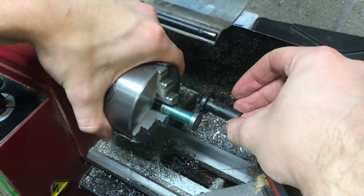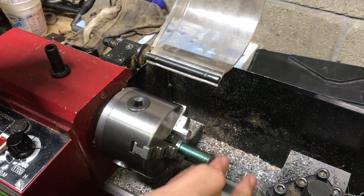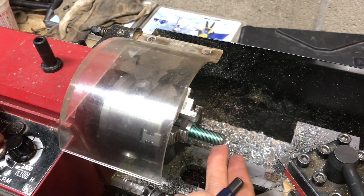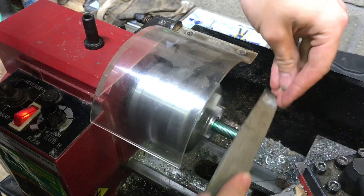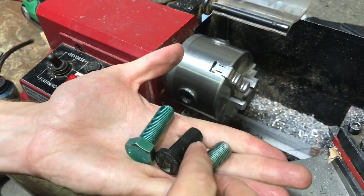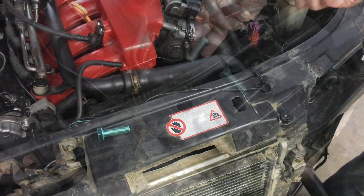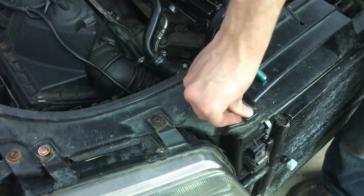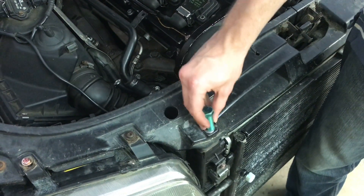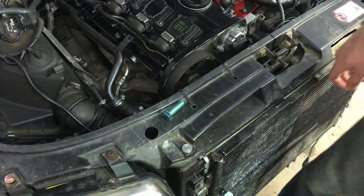That's looking a lot like the original piece. The last thing I'm going to do is just taper it — more like chamfering, I guess — just with a file, so I'm not concerned about having an unstable setup. I'm not putting a lot of tool pressure on it. I think that's pretty good — right out of a bolt. And that should work as an excellent replacement for our missing plastic. Here's our original piece, and this is the custom bolt piece. It looks pretty clean — it doesn't look quite as hacky as throwing just a bolt in there with a hexagon and everything. That's a nice little plug.